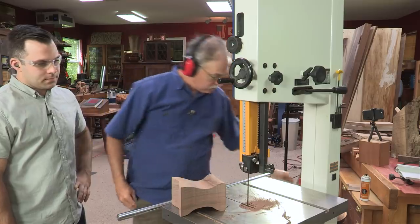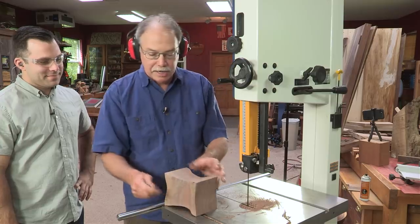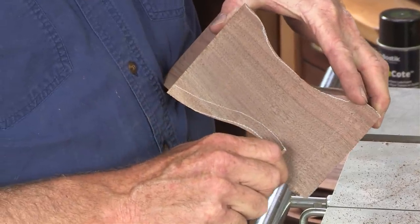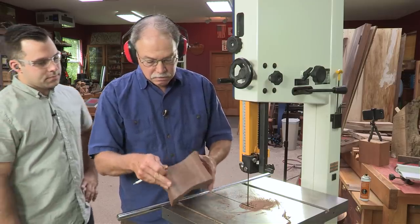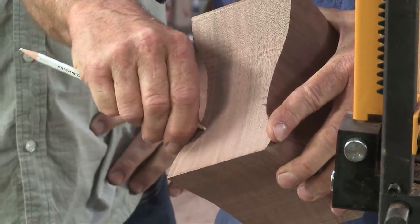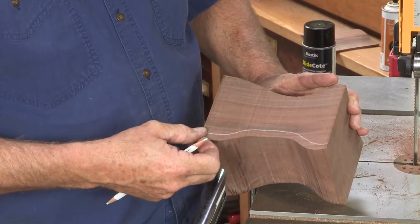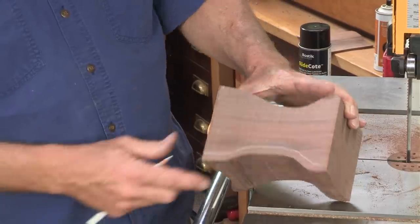The next step — you don't need a marking gauge for this, because your thumb and your pencil is the marking gauge. You lay in the thickness of cut using your thumb and pencil, just like that. That will cut off the lid; this will cut off the bottom. You want them to be about three-eighths of an inch in thickness. Once you have those two pieces cut off, we can core it, cut off the locking tab, then go on to gluing it up.